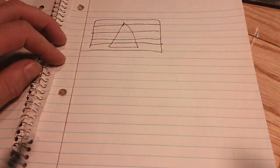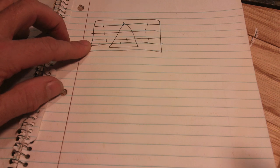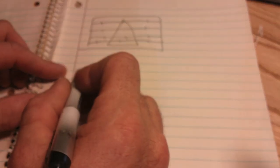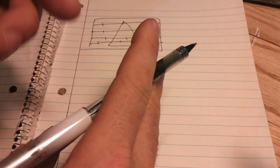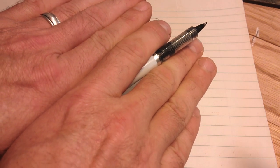The boards are slats and I'm going to glue them together. I put my mark on them so I can keep my alignment, and individually I've got little tick marks just randomly through the board for placement and alignment. And that just shows me where to put my dowels when I'm trying to join them. The goal is I'm going to book match them. I'm going to open the two boards up, put them in the vise, plane across them, and it allows for inconsistencies, but once they're mated like that, they fit fairly well.